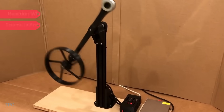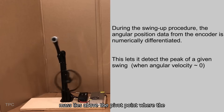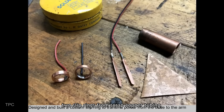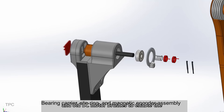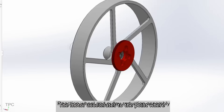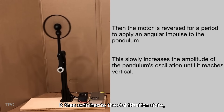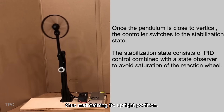Number 14. Next, we have a Reaction Wheel Inverted Pendulum — a true masterpiece in which the center of mass lies above the pivot point, where the mass can freely rotate. It uses a DC motor, two slip rings from scrap copper tubing, a copper sheet, and old DC motor brushes to enable the pendulum arm to rotate endlessly. The motor accelerates to the point where the wheel attains a vertical position, then switches to the stabilization state, where the wheel becomes immune to small disturbances, maintaining its upright position.